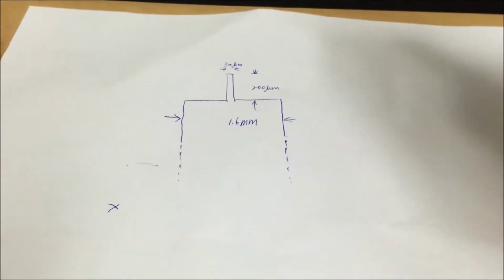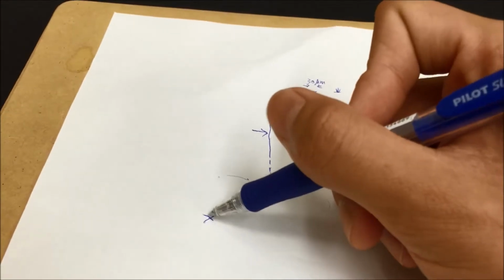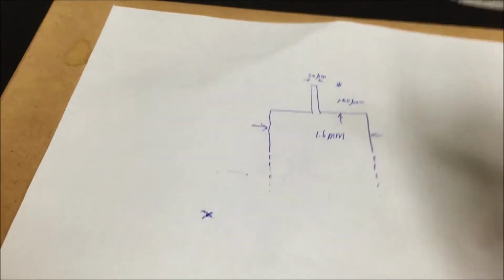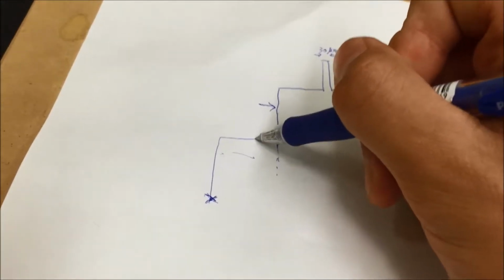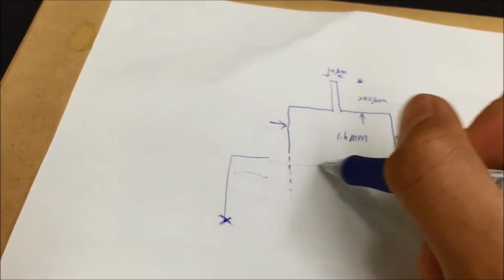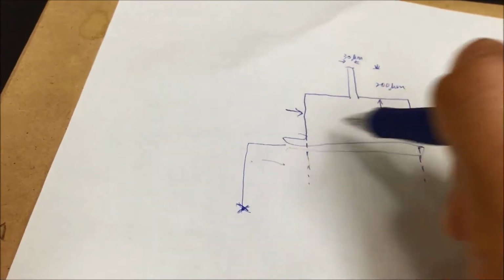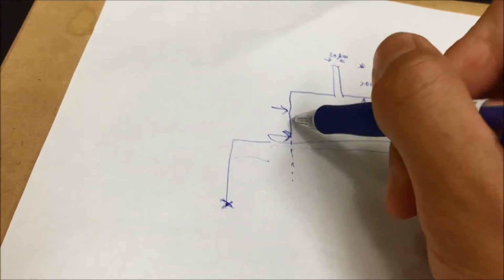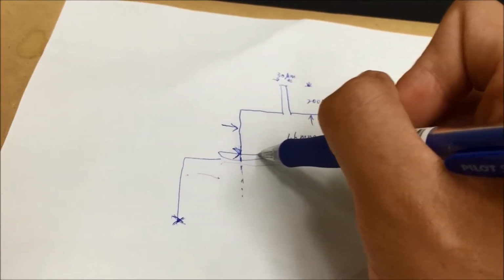So here is how the algorithm works. First, we bottom out both the X and Y screw all the way to here, and then we offset it to somewhere near the chip. Then we start scanning. Once it's scanning, it will first meet an edge, no matter which edge. Once it meets the edge of the chip, we start to measure the width.